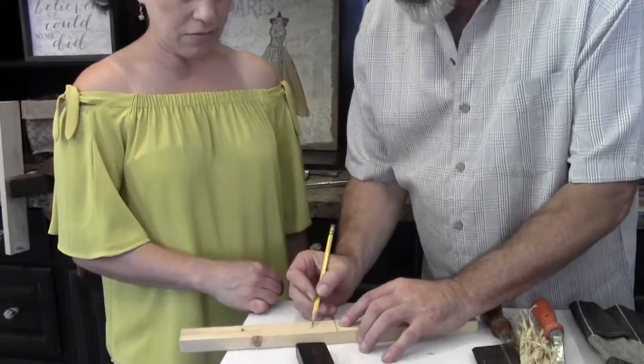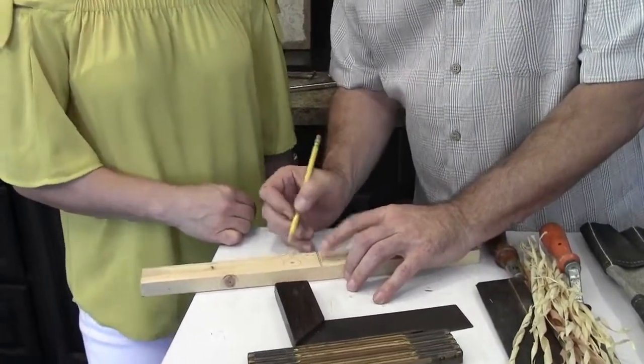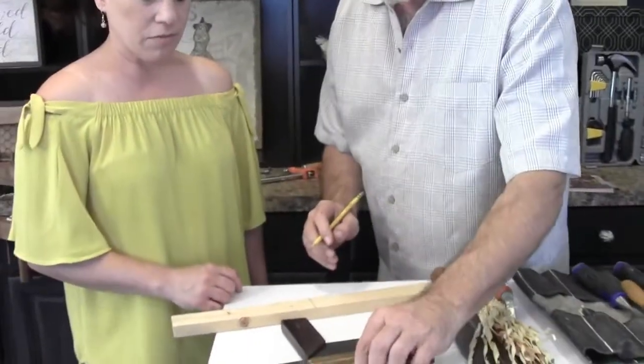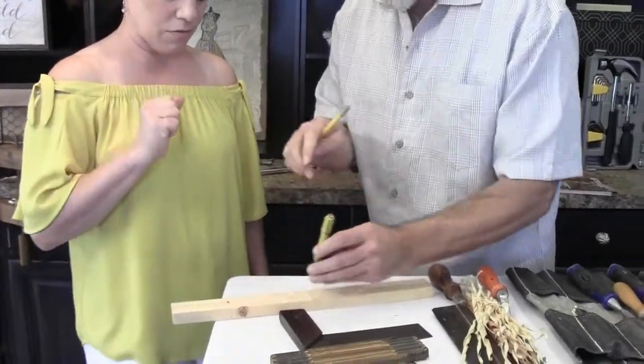But here's the thing. If I were to hit it with a hammer, there's the little nail. My hammer's this big. So I'm going to get a big dent in the wood. So you only drive the nail down until it's almost flush. Then you pick the one that'll sit inside that. Tap it in, and it'll drive it into the board. Makes a really nice finish.